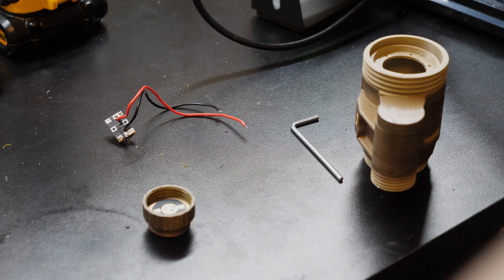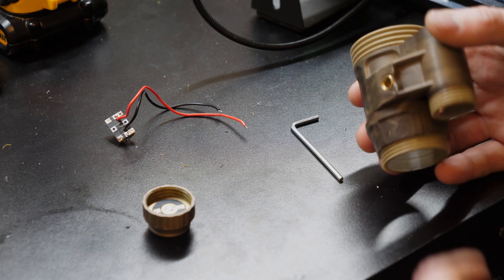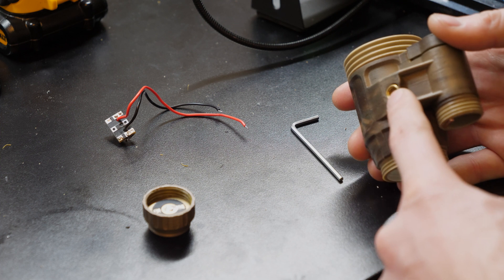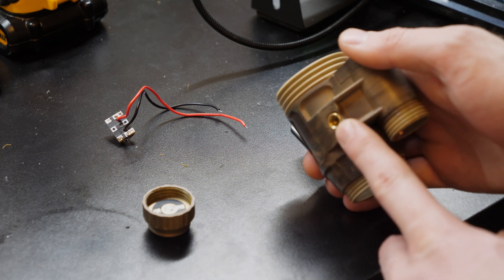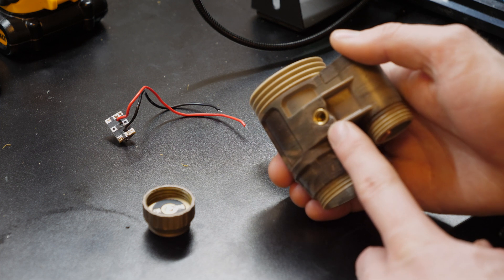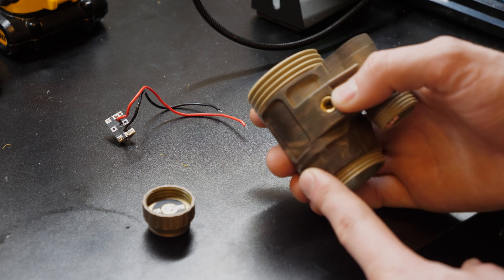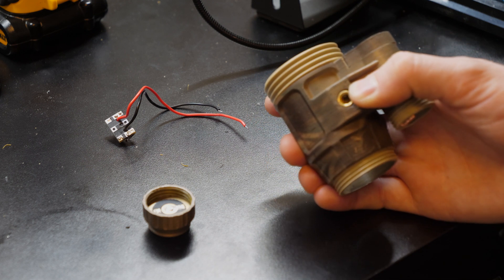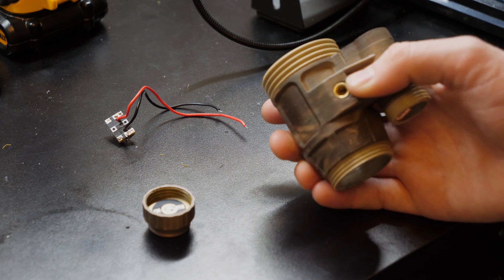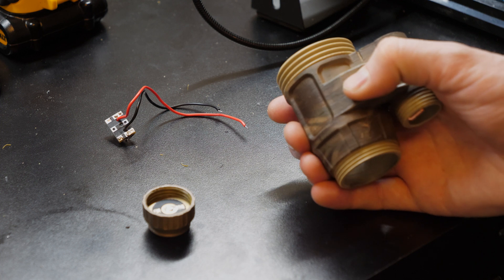I had some trouble with the eyepiece — it was kind of stiff, but it works. I'm sure I could have filed it away more. You'll also need this little brass threaded piece right here, which you'll press in using a soldering iron. Then while it was still hot, I kind of pinched it in — almost like staking gas keys on an AR-15 bolt carrier — pressing it in while still hot to hopefully retain that piece. That's the biggest piece that worries me, but as long as you're not yanking on it, I think it should be fine.